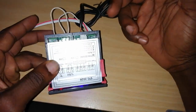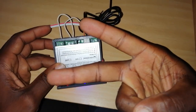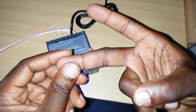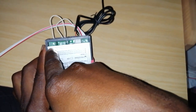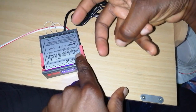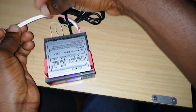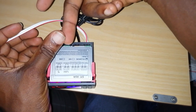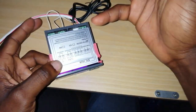What's left now is how to connect the heater and the humidifier. Your heater has two wires that are supposed to go to live and neutral. One wire of your heater has to come to port 9, and the other wire will join port 1. You can cut part of the wire at port 1 and connect the neutral part of your heater to it.